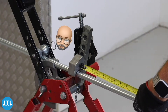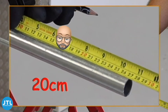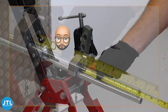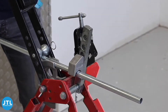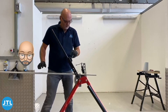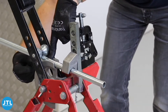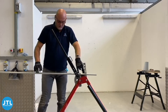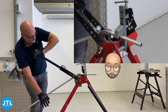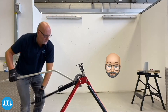Measuring from inside the bending machine, the first measurement I need is at least 20 centimetres clearance. I'm going to give myself 27 centimetres and mark the pipe where I want the first bend to start. Move the conduit so that the mark sits inside the former at the point where the conduit will start to bend. Place one hand on the pipe and the other on the handle, then pull down for the bend. Remember, the more bend you put into the pipe, the shorter the width of the set will be for the same depth.